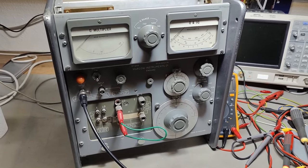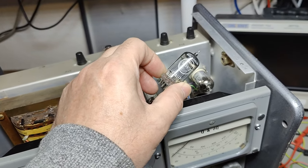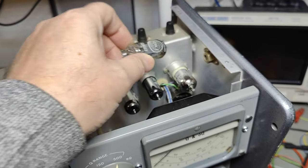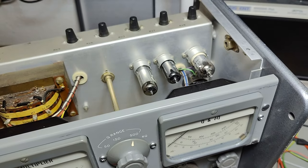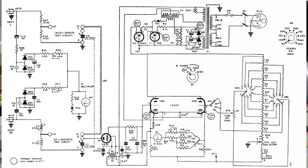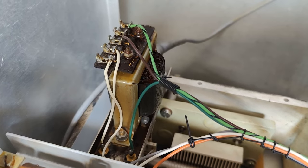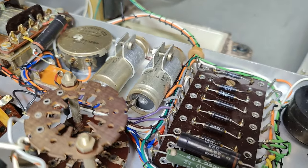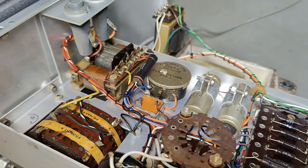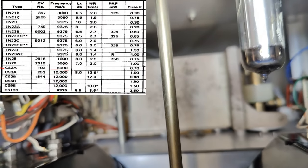I was sort of thinking I had it, but no. All the tubes are back in — I even changed the ECC-82 to one with absolutely perfect, top class parameters. And it's still the same. I know my detector diode is working at least at DC. I do get a little bit low filament voltage out of the filament transformer when it is running, so that could perhaps be the problem. We've got three transformers running in a special system here, and that is probably what is causing my problems. I also suspect the very special CS-2A diodes to be to blame, so I'm going to pull them out and do some measurements.